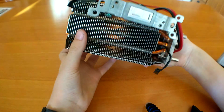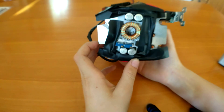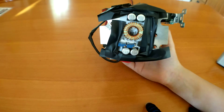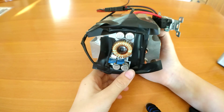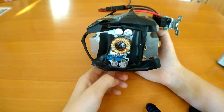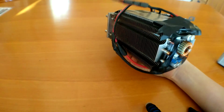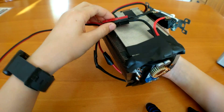I have this old heatsink from my computer, and then a 250-watt boost converter on the back, which is pretty cool. It's producing around 30 volts at 3.2 amps for this LED, and it's powered by this little Anderson PowerPole connector up here.